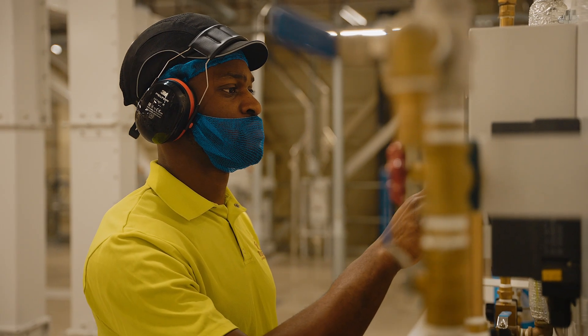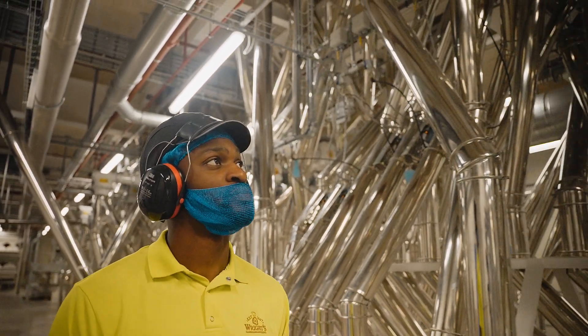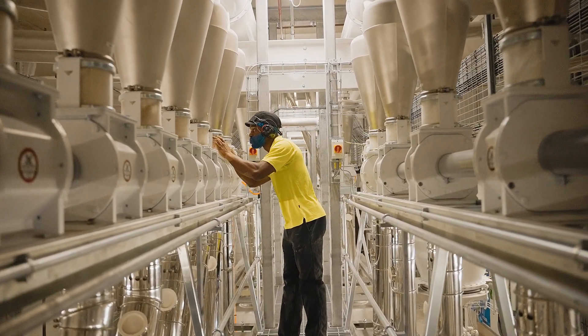Once the brake system has released the endosperm into the mill, it is purified and enters the reduction system. The reduction system comprises 10 to 12 reduction passages where we gradually grind the endosperm into flour. We don't do it in one hit — the idea of gradual reduction is that we are gentle, so we're not damaging the quality of the flour by heating it up too much. The flour is then collected in flour collection screws and transferred to onward processing and flour silos.